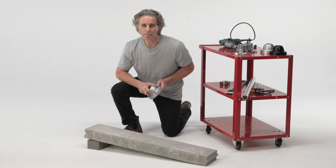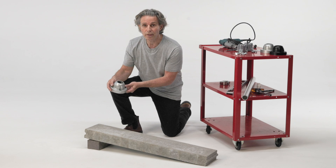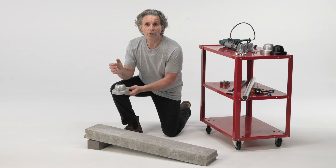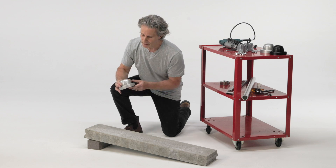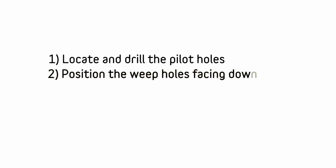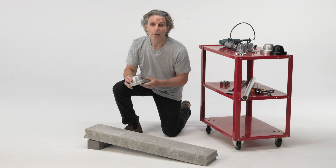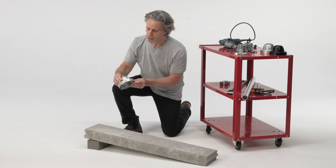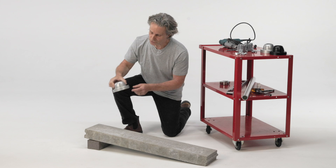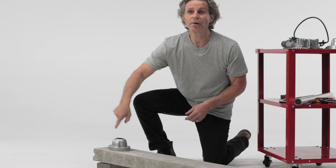The second thing to keep in mind is that you want to have the base oriented so that you can adjust the angle to match the angle of the ramp. The small weep holes that are used to evacuate water, if any should go into the base, are also an indicator of how to orient the base. The holes have to be positioned so that they go in the direction of the ramp.